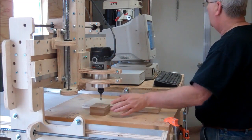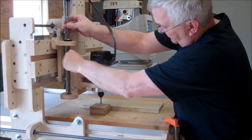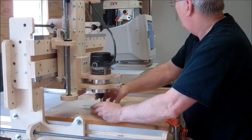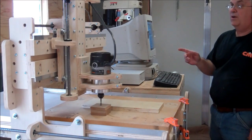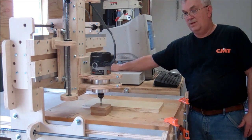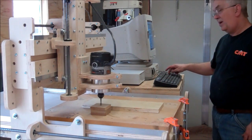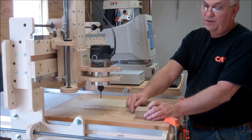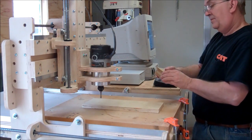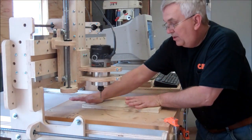So if you should make that mistake, let's go through the correct procedure. When you turn the controller off and bring the bit down and touch it off with paper — there's your zero. Then you hit 'Reference All Home' to make sure everything is set to zero. Before you hit page up to raise the bit, you have to turn your controller back on first. Now the controller and machine are both at zero. Then when you hit page up, you're ready to go — it won't plunge into the material. That is really one of the most common mistakes, so make sure to learn it.